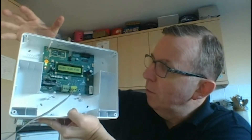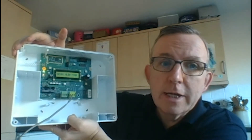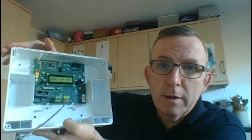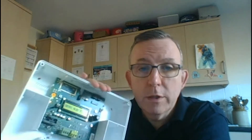Just something to be aware of: in the top left hand corner, if you're facing the unit, are your diversity antennas. They must be at least 400mm away from any metal objects, so keep them a good distance away from things like metal ceiling tiles and pipework. Also consider that the advice for fitting these is to keep them at least two meters, three-dimensionally, away from any noisy electrical equipment — things like lift switchgear, plant inside plant rooms, or very high voltage cables.